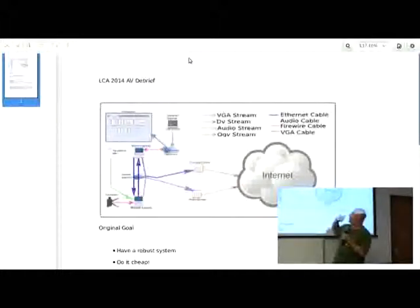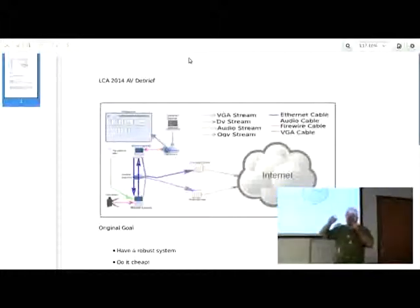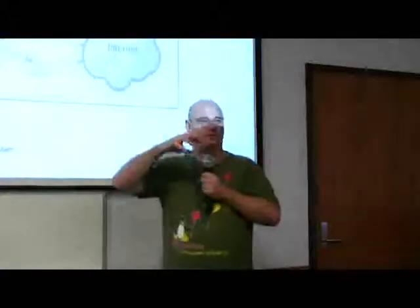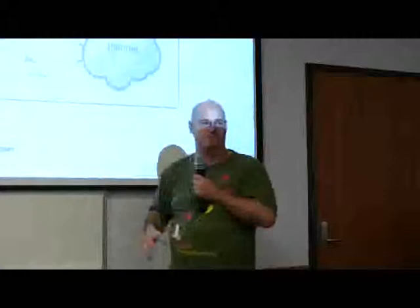So the Twin Packs pipe up to the screen, go to the laptop, and then go to the master laptop. They split the stream, so they effectively act as a double adapter. Pipe that to the laptop, the laptop goes over there and pipes it to the master laptop. And the master laptop captures a camera, either directly through its own FireWire port, or through another laptop, much as the slave laptop. So you can have multiple slaves around the place, so you can have multiple cameras.